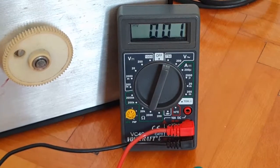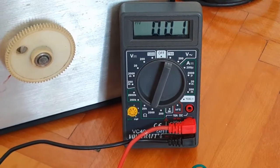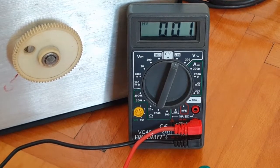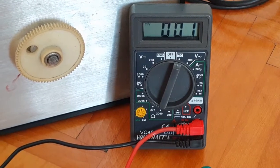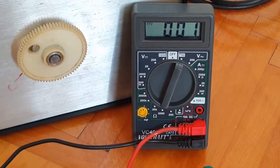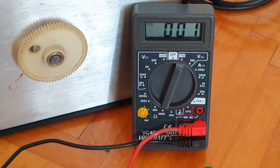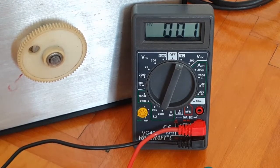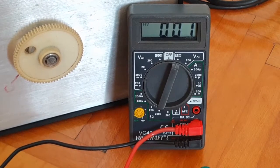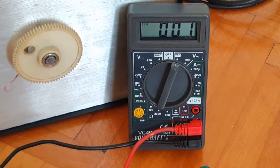This is just again the up close shot on the digital multimeter, so it has been set in the 750 volt AC measuring range because we'll be going beyond 200 volts. So this is how it's supposed to be set up, so that we won't burn out anything or destroy the multimeter in the process of this testing. So this is how everything is supposed to be connected.